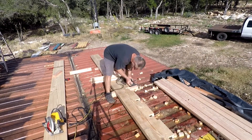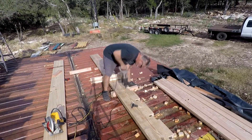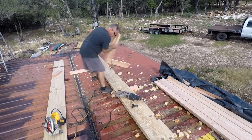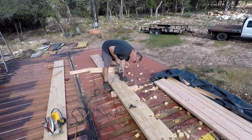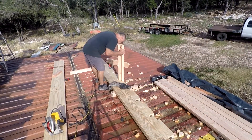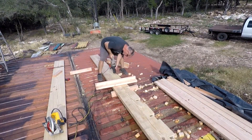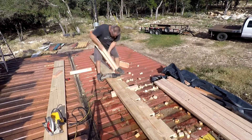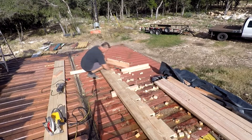To explain the outside rafters: you can see me holding a little L-shaped 2x4 section — it's basically a 2x4 with another one nailed to it. Those are support kickouts for the side overhangs on the roof. I'm cutting two rafters clamped together at the same time — one goes on the left and one on the right side of the roof. I pre-built all those kickouts the day earlier. The overhangs are all 2 feet to the outside of the fascia.